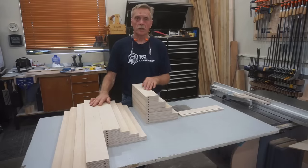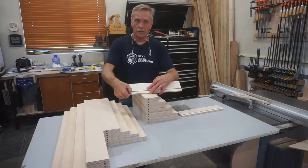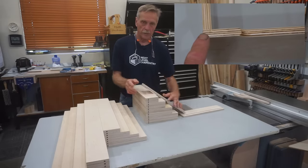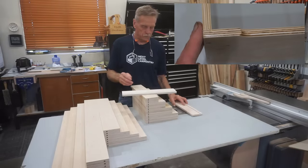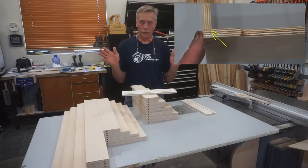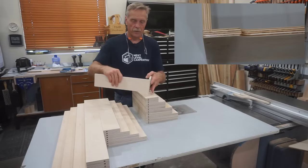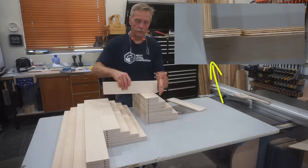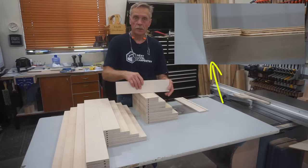Making the corner joint that I use on these drawers is a two-step process. The first one starts out by making an eighth inch crosscut dado that's set back from the end of the drawer side, the thickness of the drawer side. And the second step is putting a tongue on the end of all the front and back pieces. This way, the side pieces run the full length, and the fronts and backs run into them. So on the finished drawer, you're not looking at end grain. The drawer front covers this, and the sides cover the front and back for a nice clean looking drawer.